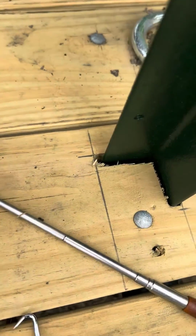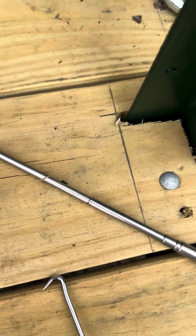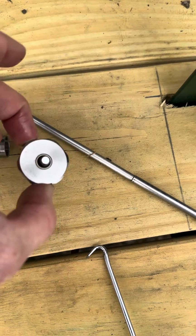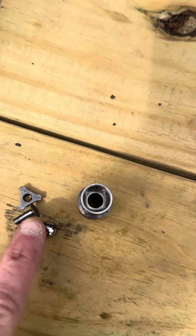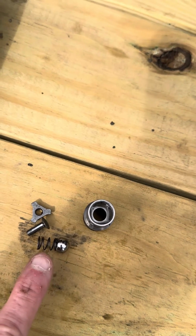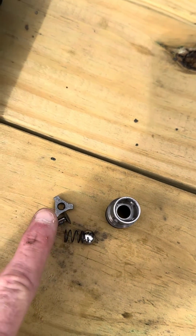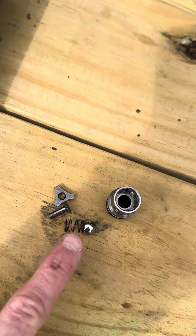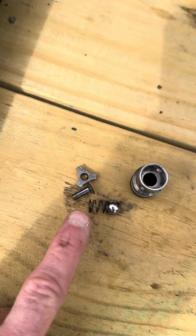It's a two-part valve. This sits down inside with the ball facing up, and then this screws into the block on top of that. This is the old one. This is the problem. They had a problem during manufacturing with these valves. They blow apart, and all these parts drop down into the hole and do not really let enough fluid go through.